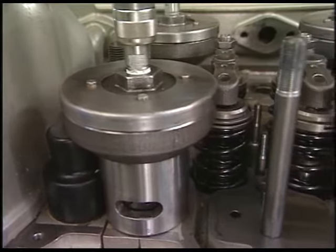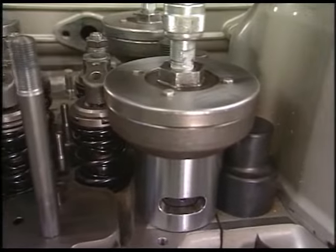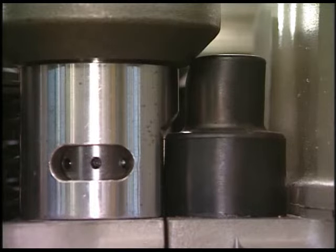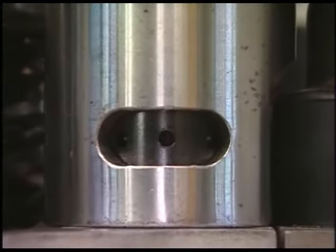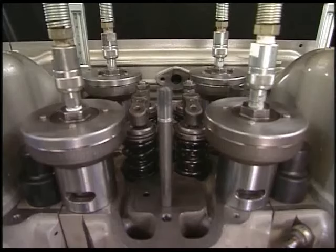After the hydraulic jack is set into the four-cylinder head bolts, check again the direction of spacer. Check that it does not interfere with the tightening nut of the adjacent cylinder head bolt, and also if the hole for loosening the tightening nut of cylinder head bolt can be seen from the clearance of the spacer. This is the end of the work for attaching the hydraulic tool.